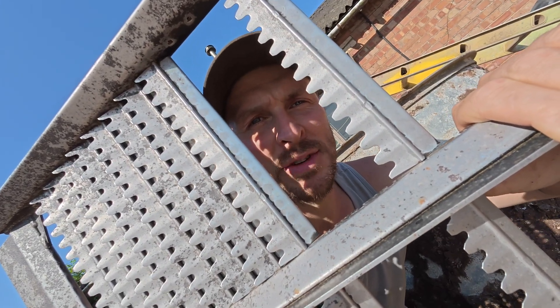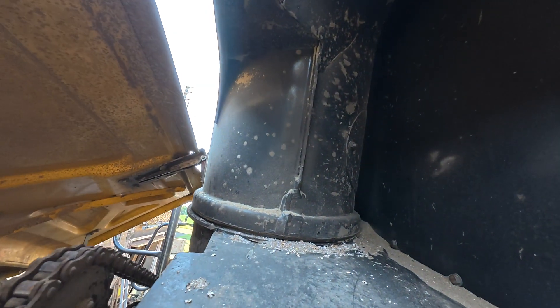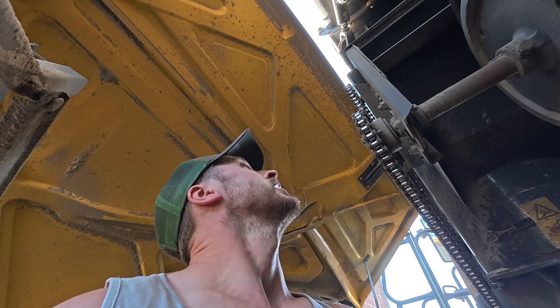There was the piece of sieve I found in my returns - that turned out to be the pre-sieve. It's the only sieve I hadn't changed on the combine since we've had it. Upper and lower sieves had been done, but it wasn't anything that actually gave us any real downtime - just had to get a new one sorted and swapped it one morning before we started. We did a rather major repair on the auger before harvest, and that's held up nicely so we must have done a good job. 850 acres through the old girl this year - all things considered she's done fairly well again.